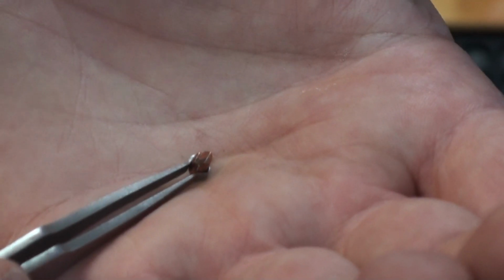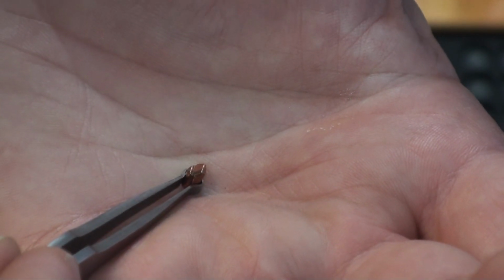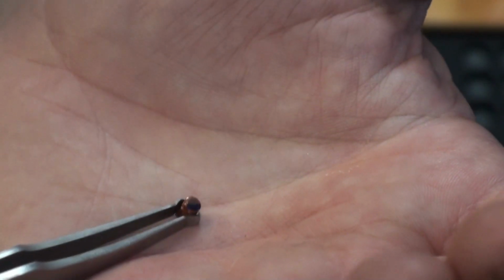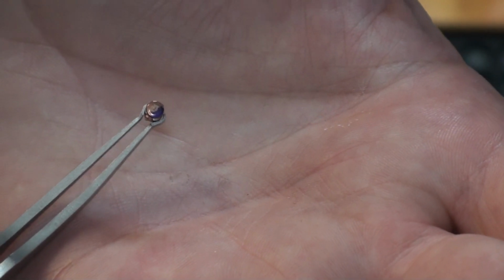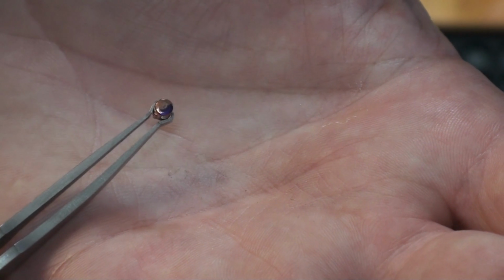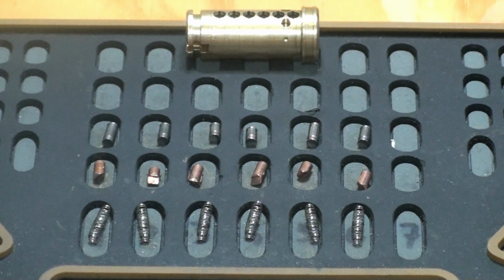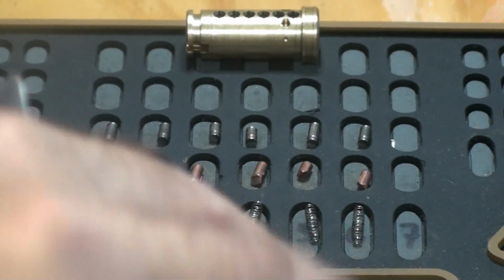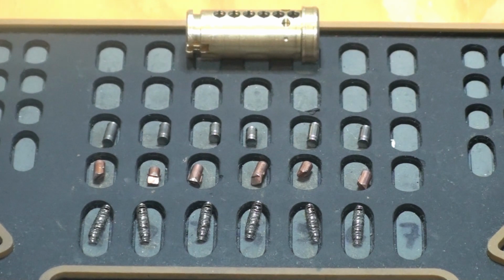It comes to those two different peaks there that you can see, and then as well as that there are those wings. So we've got those little wings on the side like so, you can see those there, which keep the key pin in the correct orientation. And you can see why that would be important, because if the key pin was to rotate in its chamber, then of course you're going to get the wrong part of the key pin interfering with the wrong part of the key, and the lock would jam. So you need to keep it in position.